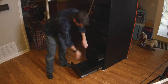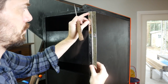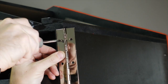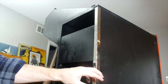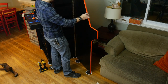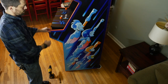And it turned out to be a whole lot of storage. To mount the side panel, I used a 48 inch piano hinge. I found the center of it and cut it in half with a cutting wheel on my Dremel tool. I lined it up with the back edge and then marked the center of the top hole so I could drive in a screw. I did the first one by hand because I didn't want it to drift at all — this needs to be precisely lined up with the back edge. For all the other ones I pre-drilled the holes and then just drove in a screw. I lined up half of this hinge with the very top and the other half with the very bottom, so there is a gap in the middle but it hinges just fine. I set the side panel on the same size spacer that I had the machine setting on, lined up the back edges, then marked the point before pre-drilling and screwing it onto the hinges. The hinge works great and all that storage is now hidden.